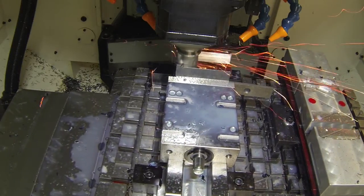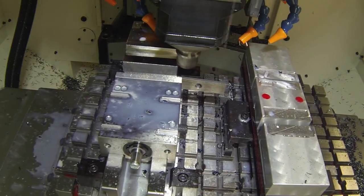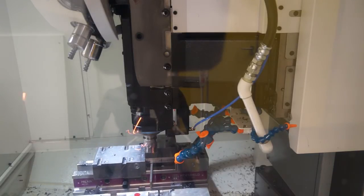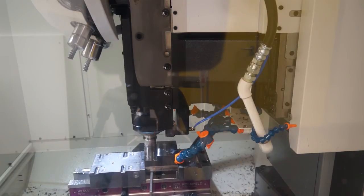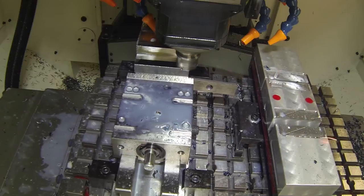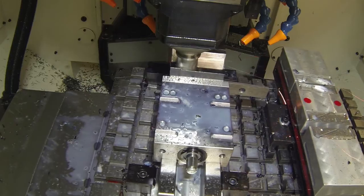A 40mm U-drill cut at the cutting speeds recommended by the cutting tool. And what about face milling? Because of the face and taper contact, we can go 5mm depth of cut on a 40mm face mill, no problem. And how does that compare to the standard BT30? I think what it's doing is reaching towards the BT40 — it's not a complete match, but it's getting much nearer to competition than it ever did before.